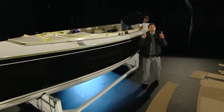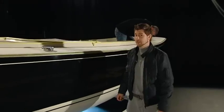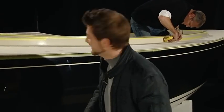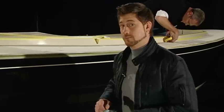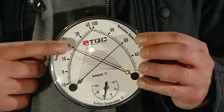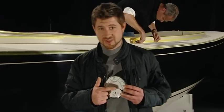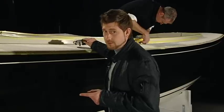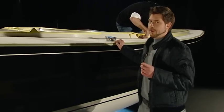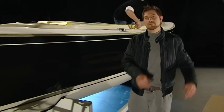Let's start the application inside. This is Marcel — he is a specialist when it comes to the application of an ASTEC deck. We will do it together, just this once. Before we start, we have to make sure that the ambient temperature is about 20 degrees Celsius. The area should be dry and the relative humidity should not be higher than 80 percent. This is a must for all your fillers, primers, or adhesives. By the way, do not forget the panels need a 24-hour acclimatization time — just leave it there for a day.